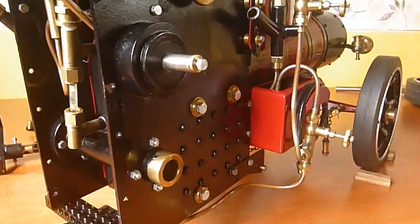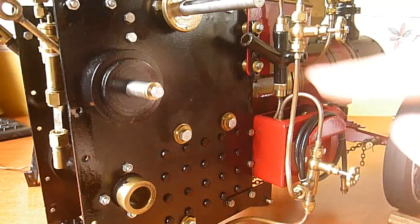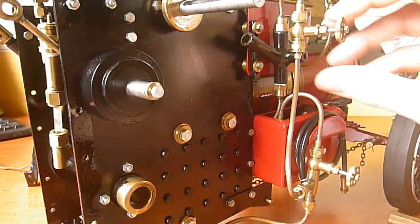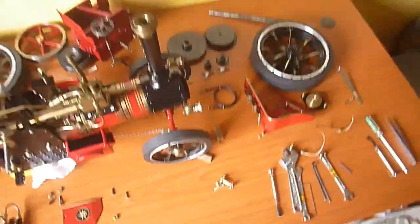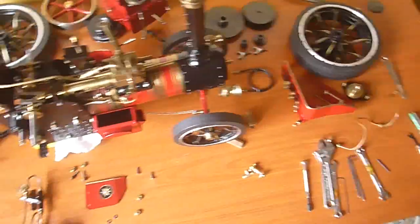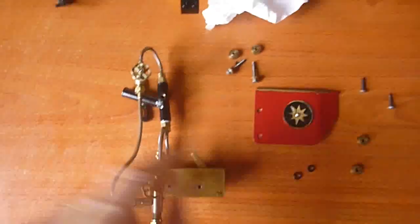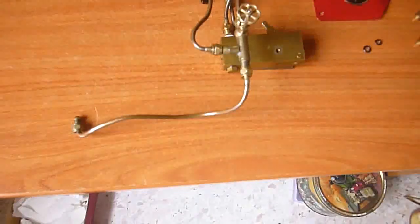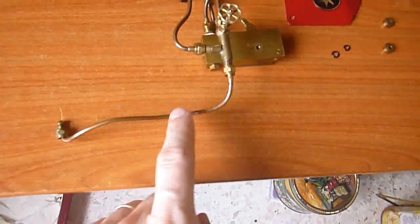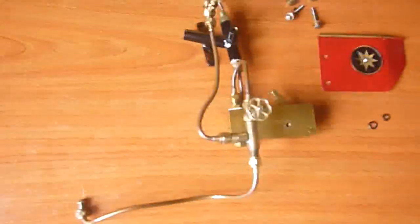This is probably also going to involve relocating some of these valves — I don't think I have enough space to work down here, and remember the wheel is going to be here, which is going to be enormous. So I'll probably shift both of these valves a little bit farther up and add the third blowdown valve somewhere around here. This is what the Marquee looks like now — just nothing but a big pile of bits. I've got the important bit I need to change right here: this is the manual pump from the belly tank and this is the automatic pump on the crankshaft end. Hopefully I can do this entire modification just by changing this pipe, without modifying any of the major components.